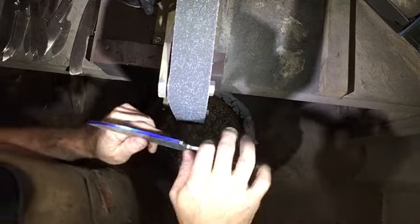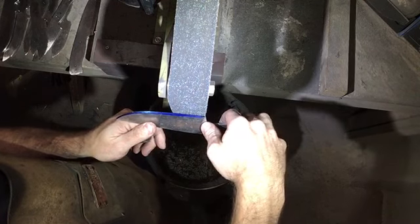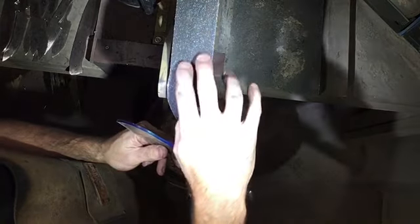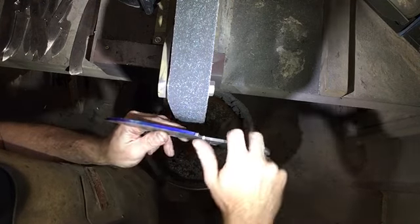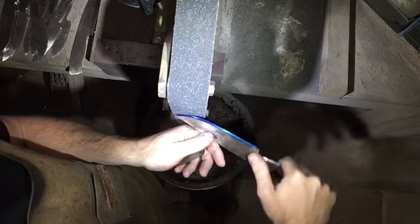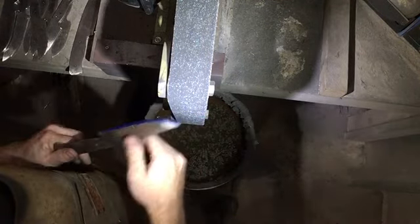Anyways, grinding the bevels, I'm going to come in harsh, like 45 degrees, and knock that 90 off. This is a semi-worn out 36 grit. So I'm going to be watching my center line that's scribed along here. I'm going to come in 45 degrees and just blast off that 90. Then I'll do the other side, like so.